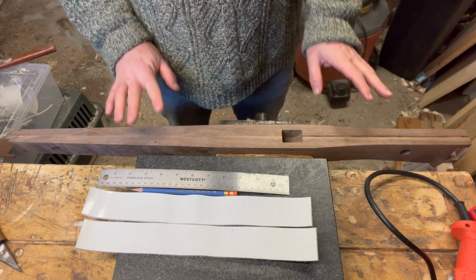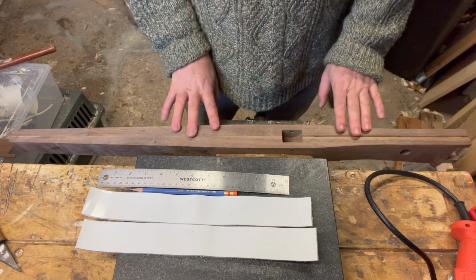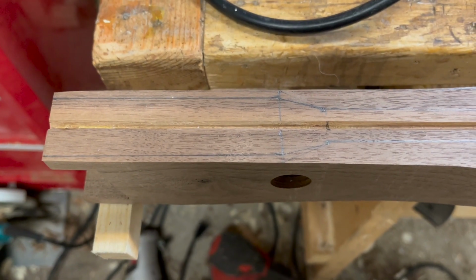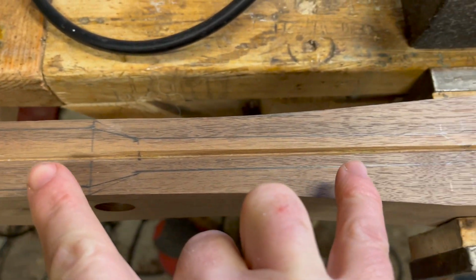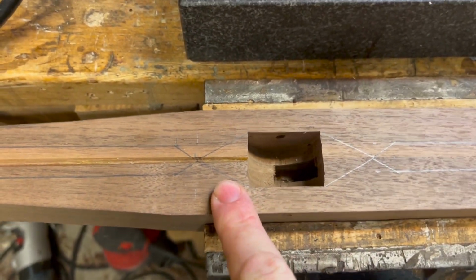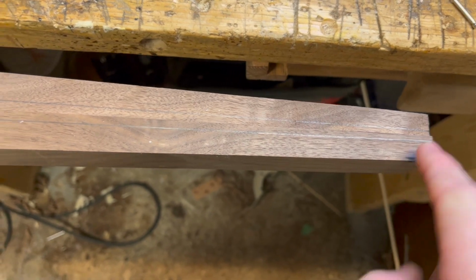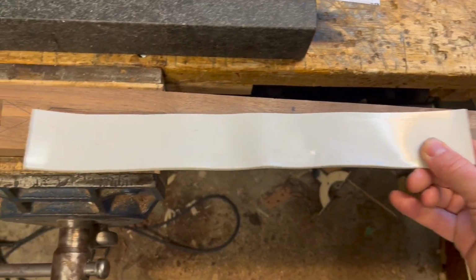And this really is a very, very typical 15th century German pattern. And of course, the inlay material that they would use, because it's what they had on hand, was bone. Well, what we have on hand is PVC sewer fittings. So this section here will be one piece. We're moving down, and this section here will be another piece. And we've got a small triangle here, another small triangle, and then quite a long piece that goes all the way down the length of the tiller. Obviously, that is longer than the PVC we have, so we'll use multiple parts.